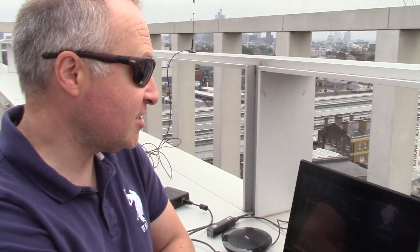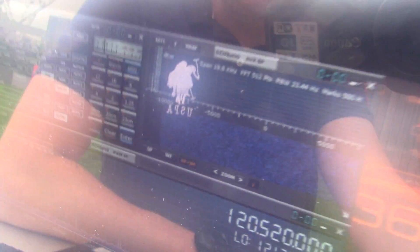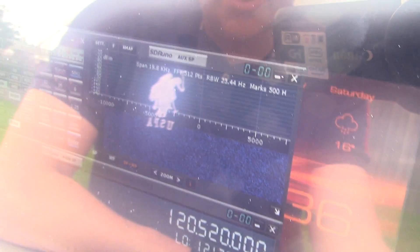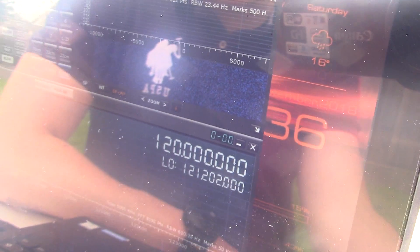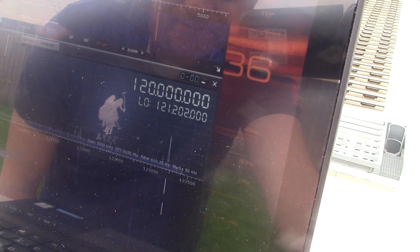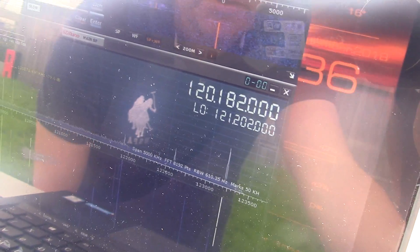The other cool thing we can do is try to pick up some air traffic. Here in London there are obviously lots of airports — we've got London City, Heathrow, Gatwick, and lots of private traffic as well. So let's see whether we can pick up something on that. You're looking at around 120 MHz on AM, so let's key that into SDR Play, hit enter and play. These little peaks should be pilot conversations — that one there is at 120.182 MHz.